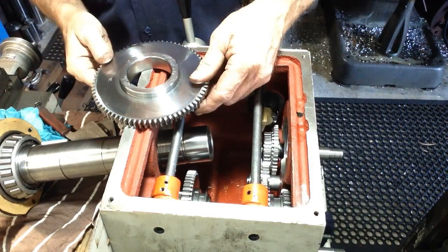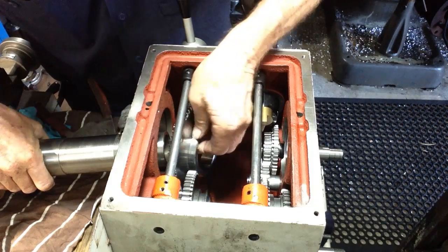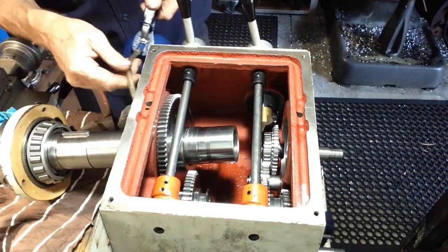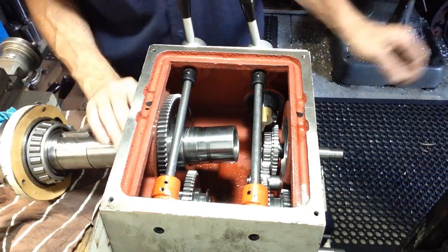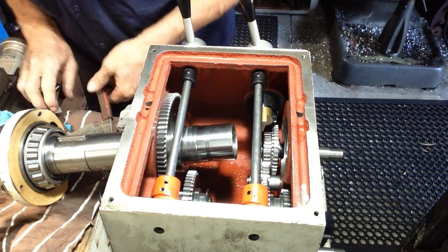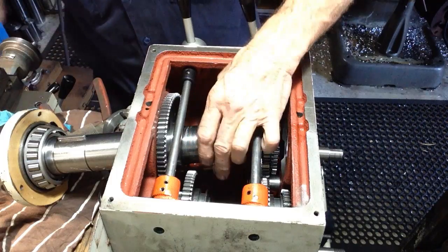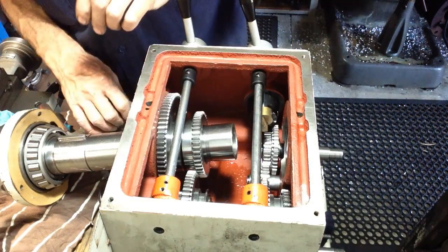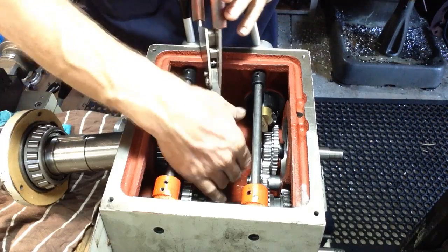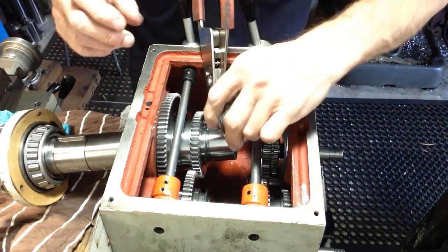Okay, so we've had a look in the parts breakdown, and this gear goes in this way around. And just chuck a bit of oil on the journals on the spindle, the greasier the easier. Very carefully assemble our gears in the correct order. So we have another gear to go on. And then we have a circlip. And your last gear, the final gear. Just goes that way.